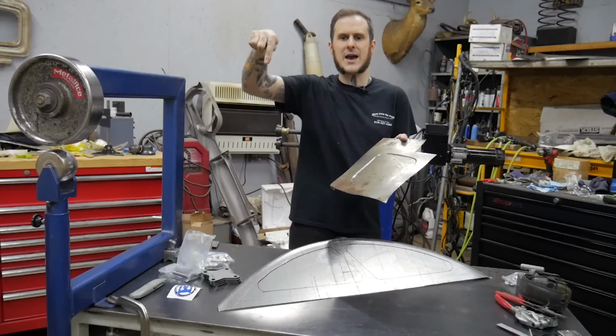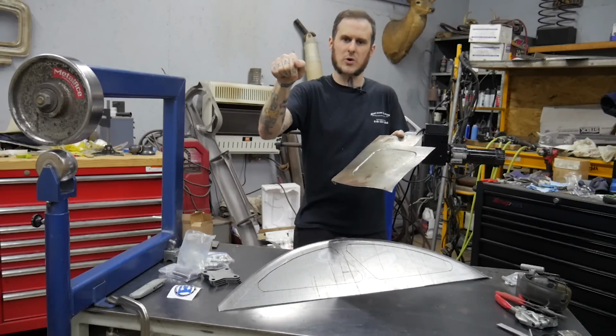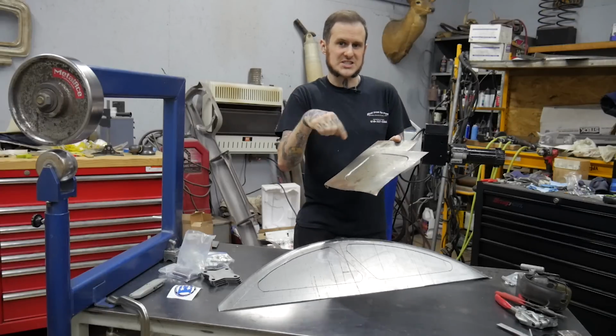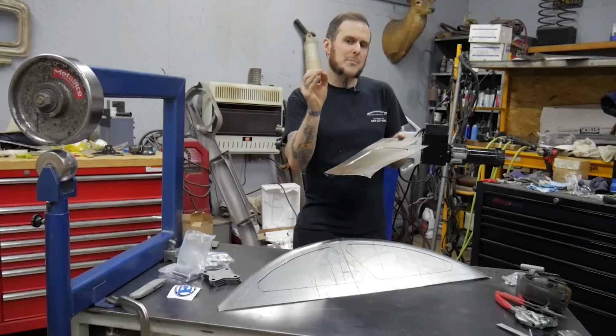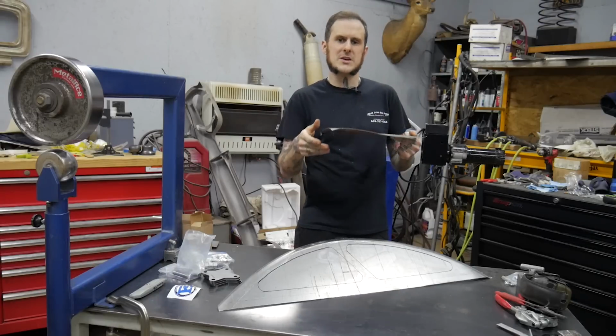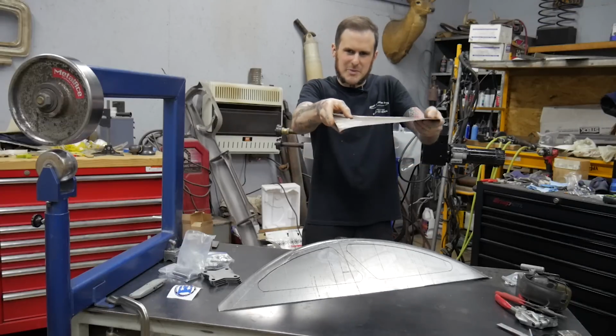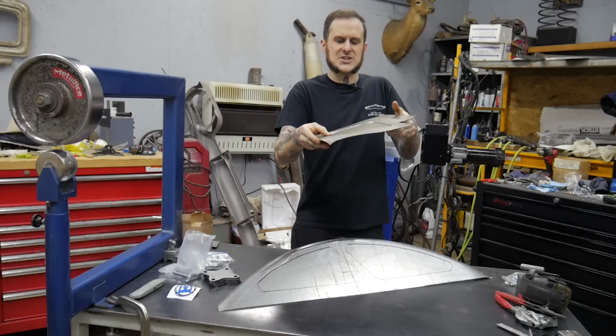And every time I went around, I turned the handle down just a little more, slowly creating that profile. You will find if you do it in those stages that you can stop before you distort the panel too much. Maybe don't take it out of the bead roller so you don't have to reset, but go ahead and check the panel for that distortion as you're going.